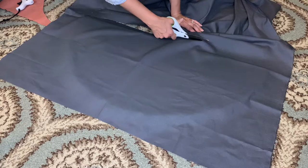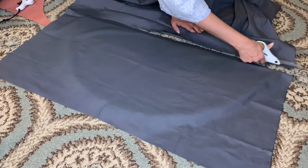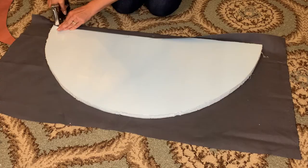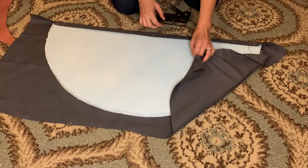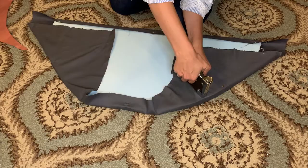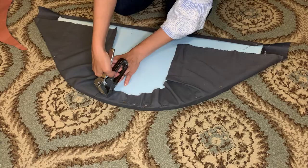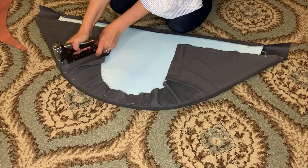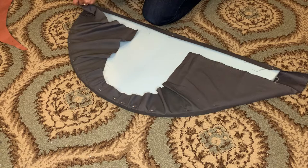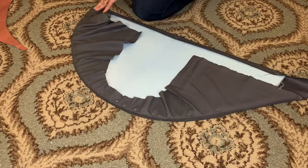Now I'm cutting out a piece of material that I'm going to use to upholster the front side. I'm going to just staple that in — it's really easy to pull on the material and get some tautness for upholstery. I don't recommend cutting off all the extra material right away. We will be cutting off that excess in just a little bit, and the key to upholstering is creating small wrinkles in between the tension points.